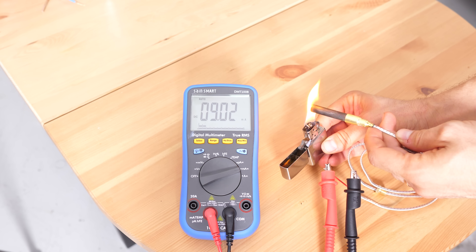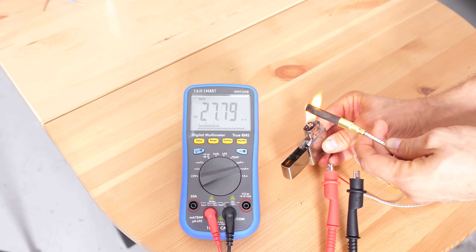A thermopile is an important component in your boiler. Your boiler has this thing called a pilot light. One of the jobs of a pilot light is to ensure unburnt gas doesn't leak into your house — the pilot light is always lit right next to the burner, so if any gas comes out it gets lit. But what if the pilot light goes out? You need some way to detect that and then switch off the gas supply. That's where the thermopile comes in. If you look just above the pilot light in your boiler, you'll see a thermopile that generates enough voltage to power a solenoid that holds open the gas valve. So if the pilot light goes out, the thermopile cools down, the voltage goes down, the solenoid shuts off, and the gas valve closes.